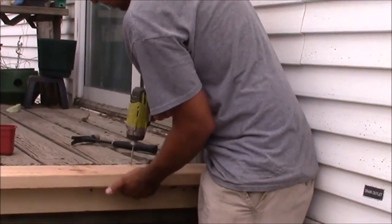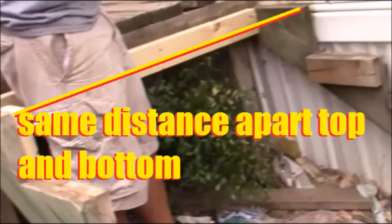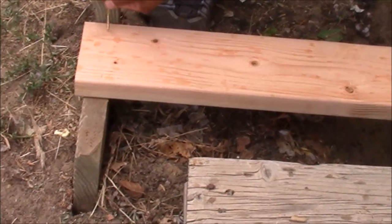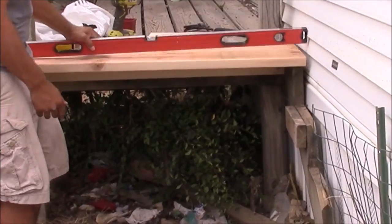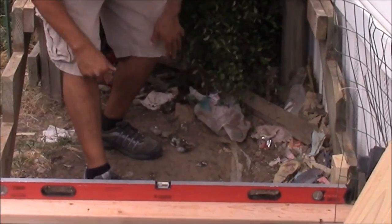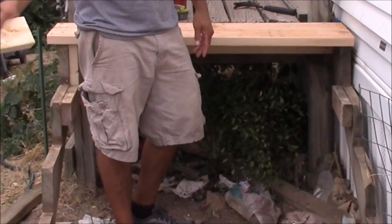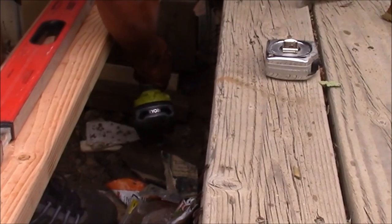Before we go any further, we're going to want to make sure that the stair stringers are square with each other on top and bottom. Make a measurement on the top for the distance between the stair stringers, and a measurement on the bottom, and make sure it's the exact same width. Once you have the exact same width top and bottom, it's time to install a board at the very bottom. Now we're going to make sure the steps are level — your top step needs to match what your porch already is, and your bottom step needs to match your top step. In this case, my bottom step is severely off — one side needs to be elevated about an inch and a half. So I'm going to use a shim between the stair stringer and the paver, and secure that with screws.